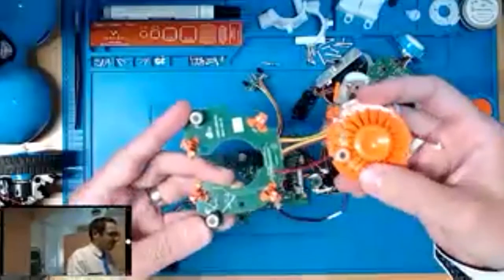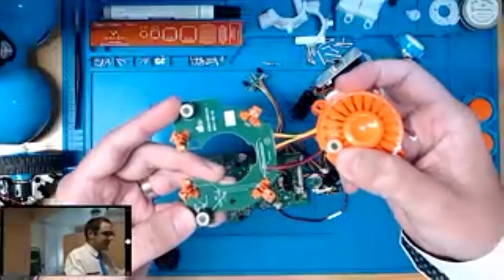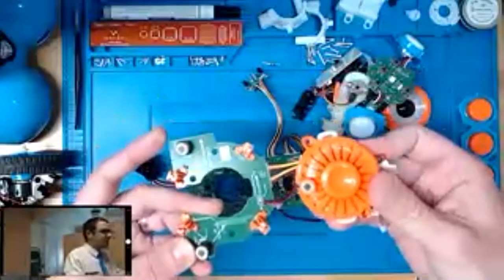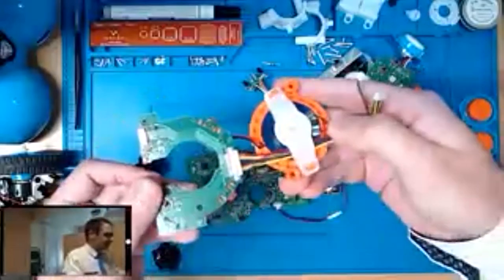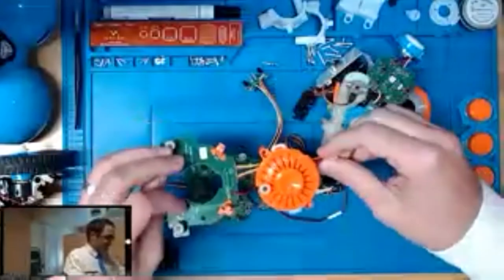Additionally, on this assembly, you can see that there are three microphones, two mounted here on the circuit board, and the third one is mounted inside the enclosure that holds the speaker. This is what allows Dash to determine the presence of sound and to look towards its original sound source. Additionally, here from the underside, you can see the speaker is mounted there as well. And again, this assembly also connects back to the main circuit board.